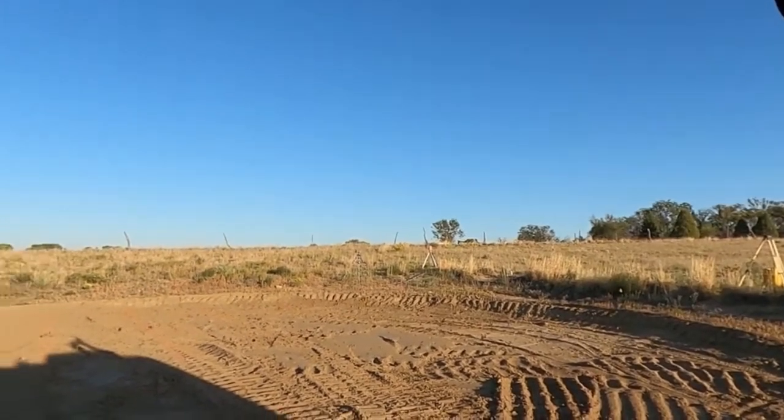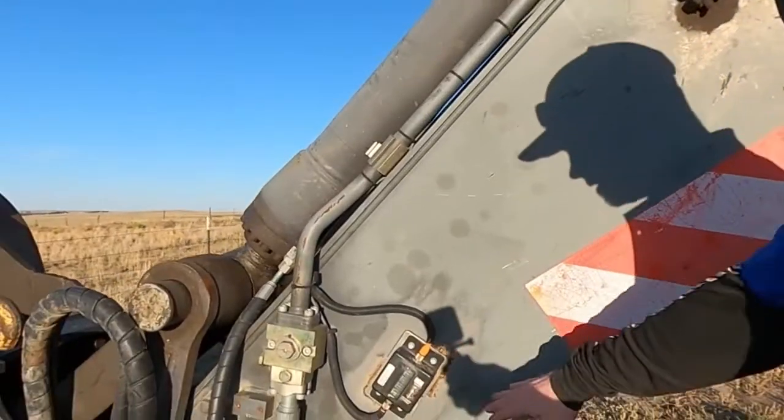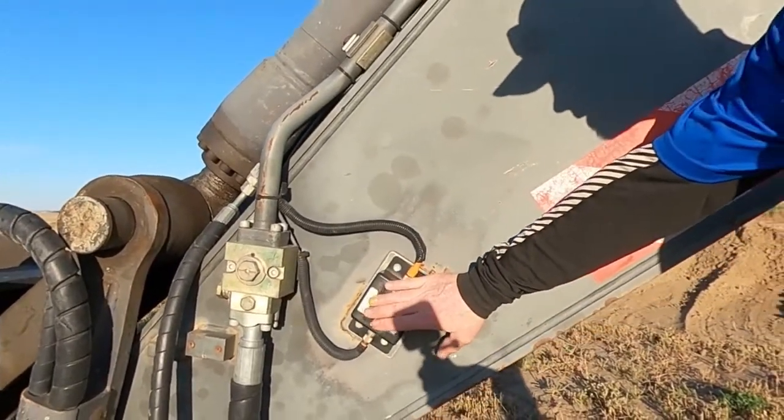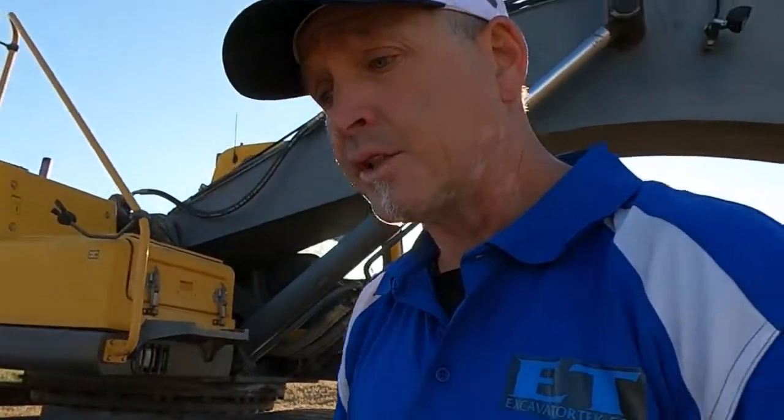We're using a rotating laser which I've got set up over on the hillside, and we've got a sensor on the side of the stick. We're going to be using this sensor right here to pick up the laser beam, and the computer calculates everything you need to know from there to get down to your footing elevation. We'll probably just go with single slope mode today. I usually just leave the thing in dual slope all the time, but that's not going to be necessary for this one. We'll do another video in the future using the dual slope method.